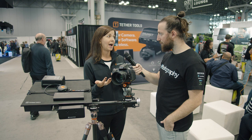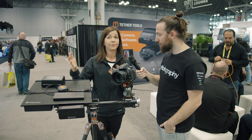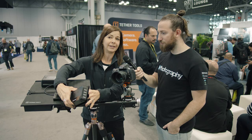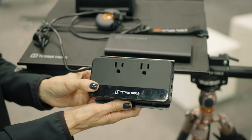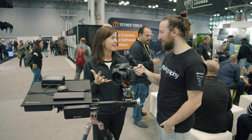So what's next? We also have the ability with the DTAP — because it's so portable and viable in both photo and video — to convert that power to AC power. This little device right here plugs directly into the DTAP battery and has two AC ports. We have it here as 110 volt for the US and Canada, and also in a 220 version for all international users. It conveniently has four extra USB ports on the side, so you can power camera batteries, laptops, or anything USB 5 volt. The only limitation is you can't use it for anything with a heating element like a strobe or curling iron — stick with things that are under 87 watts for that device.